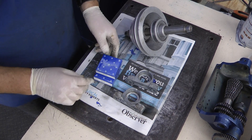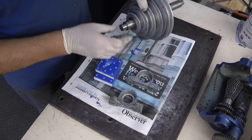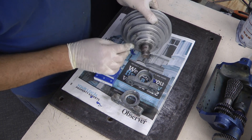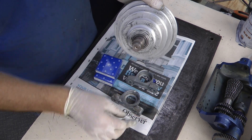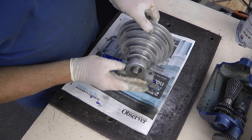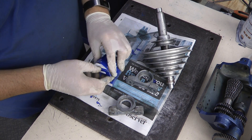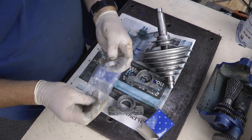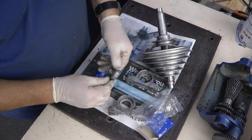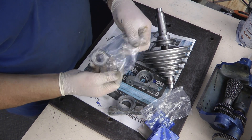Secondary shaft bearing replacements. The old bearings have been removed off the shaft - the shaft's cleaned up. Moved out the carriers. I can see some minor damage here - at one point this pulley must have drifted over and rubbed onto this. But as I say, minor damage, nothing to really worry about. New bearings - gone for the same as the original ones with steel seals, double-sided seals. You can get a rubber eye seal but the other ones have lasted long enough since '72, so should be good enough for another 40 years.